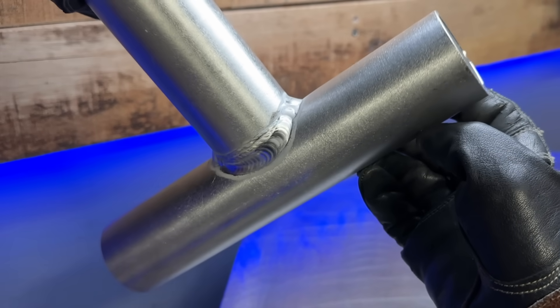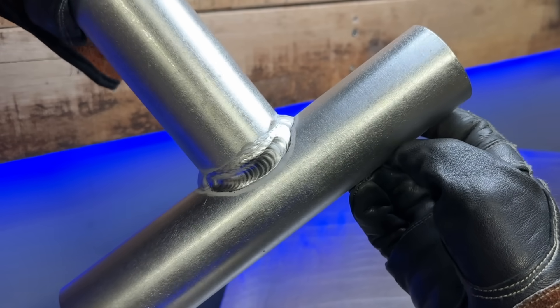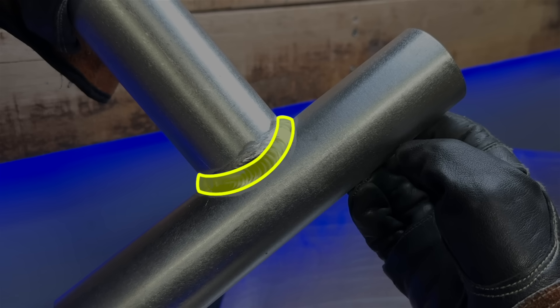After I've totally filled it up, I can run some dry passes over the top. This is going to totally blend or wed the edges in. I want to make sure that when I do this, I leave a perfect special little spot, because I'm going to run a show pass or a cosmetic pass over this later after my grinding shenanigans.